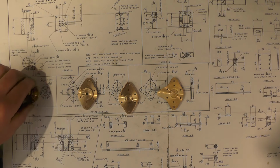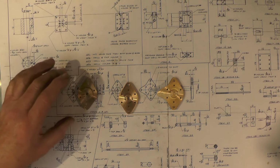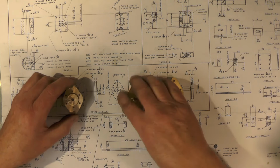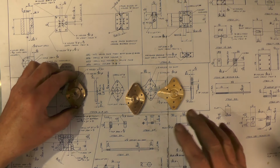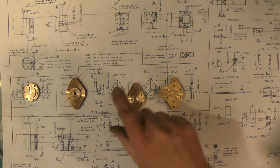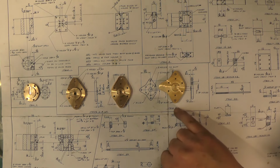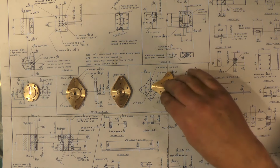Right, item 3 then, that's the top steam cylinder cover, that's complete. Item 4 is the bottom steam cylinder cover, which is the one with the 3/4 spigot, that's complete, except it says there's a cutout on one of the flanges there, on I don't know which side yet, and I don't know what the cutout's for. Like I said earlier on, there's no dimensions been given to put that cutout in. It's definitely offset from the centre line, but there's no measurements, so that'll be for later. Item 4A is complete, that's the one with the 1/2-inch spigot, and then item 6, that's complete, that's the bottom cover of the pump base, so it'll sit on that.